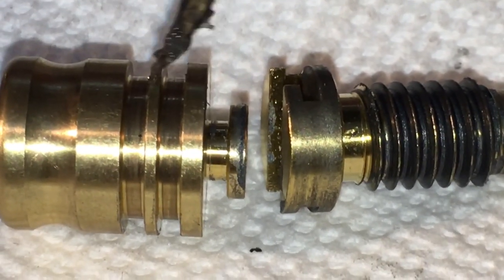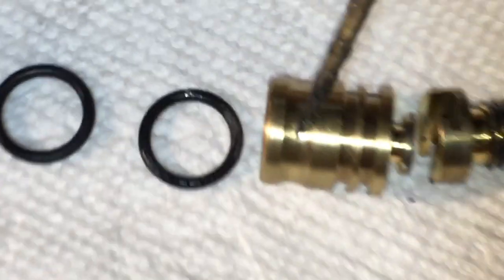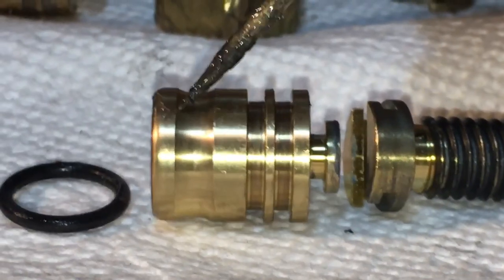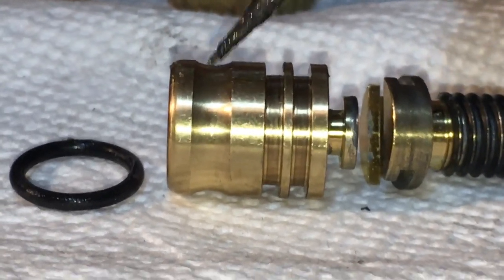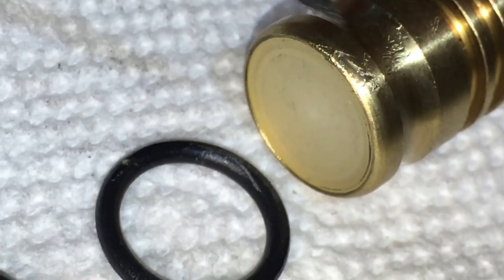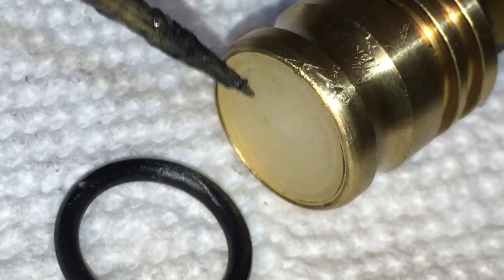Your leakage path would be past these O-rings here for any vacuum, and the cylinder right here — that's the cylinder your O-rings ride up and down on. So your O-rings are right up and down in your refrigerant passage. This little indent right here is your refrigerant passage, and this is tapered down — it's not fully bored. If you look at it from the side, this seems a little smaller than this up here. This is your refrigerant passage, and this is your seal that bottoms off — that little ring you see going around, that little groove. This is your sealing surface.